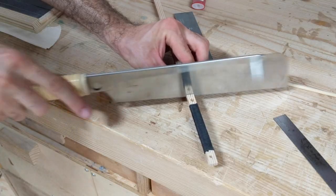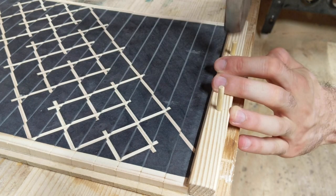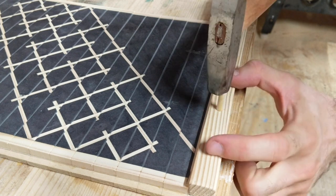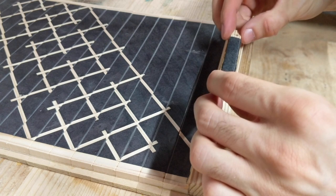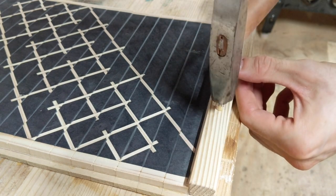After drilling a hole on either end, I can cut the handle to size and use bamboo skewers to attach it to the door. To avoid putting on too much glue and having excess squeeze out, I use a piece of canvas to brush the glue onto the dowels, then lightly tap on the handle to get it to seat in its final position.